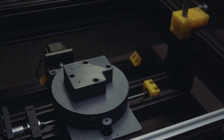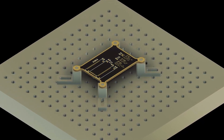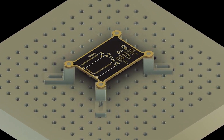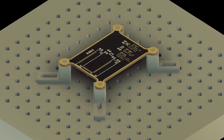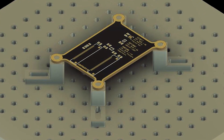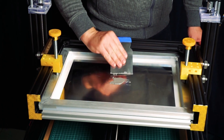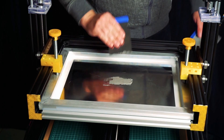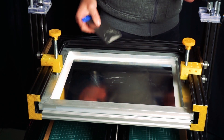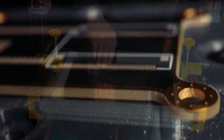It was important to have a totally flat surface underneath the entire PCB, because in other stencil printers the PCB is basically hanging in mid-air only supported under the mounting holes. The normal design could push the PCB downwards when you apply paste, so that it can get trapped on the underside of the stencil, which can lead to a bad paste job. With full support under the PCB you can apply excessive solder and pull it off in all directions multiple times without getting anything smudged underneath the stencil.